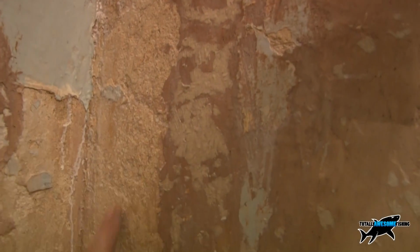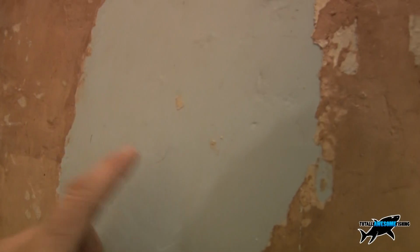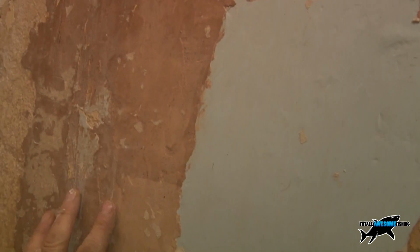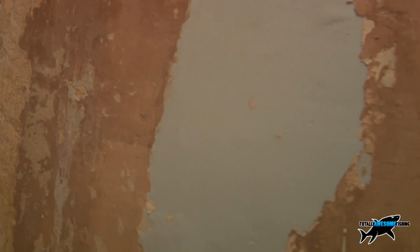So I'm going to crack on with this wall, even down to the original concrete there. And I've tapped all this. Now that's hard, that's hollow, so that one wants to come away, but by putting this Artex over it, I'm going to get a good few more years out of that.